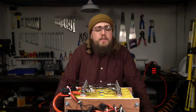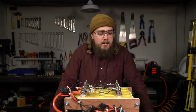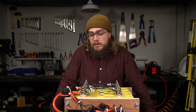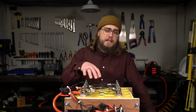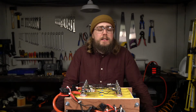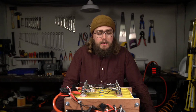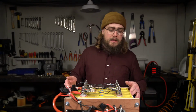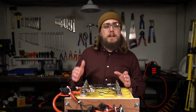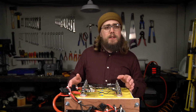I mean, like any of these sort of things, there's always going to be faults with some of the products, but consistently they are very high performing. If you've been following some of our videos here on TikTok, this week I've been doing some tests on these cells. I took the whole BMS off and did individual cell tests, and these cells are rated at 200 amp hours, and I've been getting like 250 amp hours consistently from each of the cells, and they're all pretty close in terms of their performance. Then when I put the battery back together and put the BMS on, I did a capacity test until the BMS cut everything off, and it did the same. I think it tested out at like 247 amp hours or something like that.